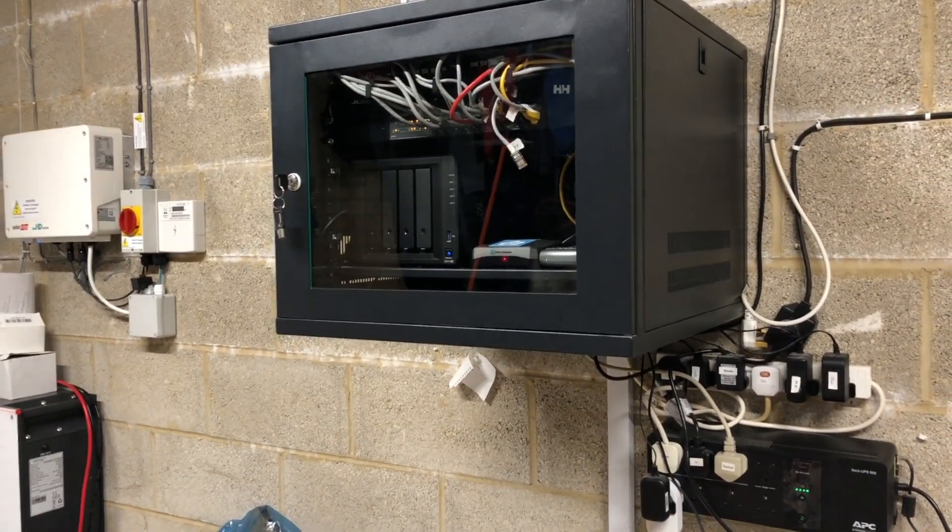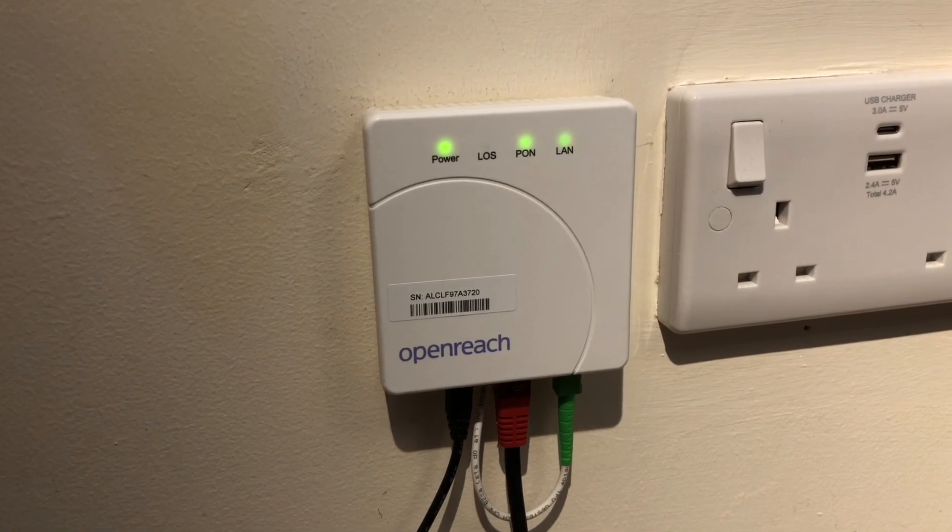I still have that third one in the garage, but I got rid of the one in the study because it became faulty, and most equipment in there is either a laptop with a battery, or I don't care much about keeping it running during a power cut anymore. I then got thinking about the one in the living room. The battery in that was pretty shot and needed replacing anyway, and it literally only provided backup power for my router and the fibre modem. Both of those devices are DC powered, and it dawned on me that a massive APC UPS that stores energy in a 12V DC battery, only to convert it back to AC to push it into a device's DC power adapter, must be quite inefficient.